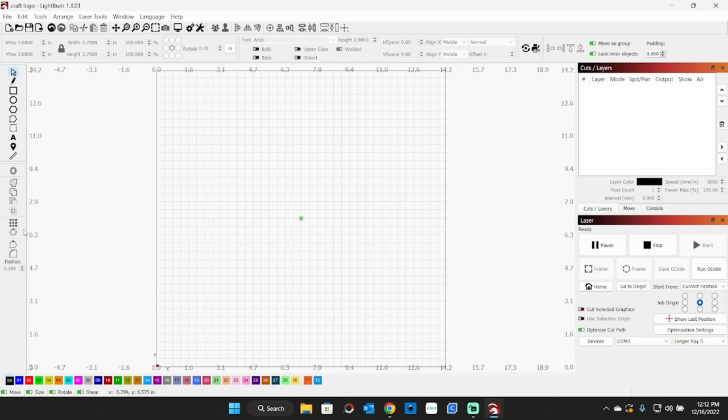I've measured the smaller coaster — it is 3.75 inches in diameter. I'm going to go over here and grab a circle and make it any size you like, then back up to the arrow. Make sure your padlock is unlocked because we need to make this the same all the way around — type 3.75, otherwise we'll have an ellipse. Now lock your padlock. Go down here to where it says T1 — that is now your toolpath. Your graphic will need to fit inside of that. This will only show and frame, it does not engrave — there's no output to it, as you can see in cuts and layers. Strictly just a toolpath.